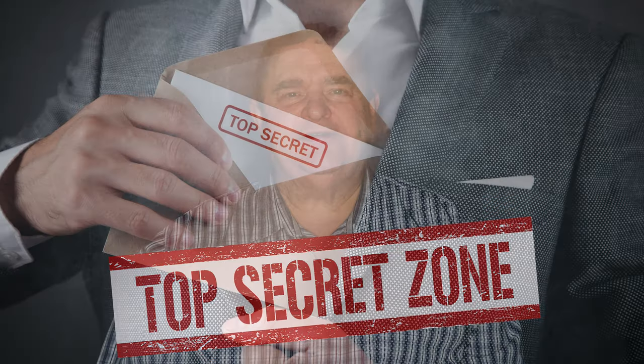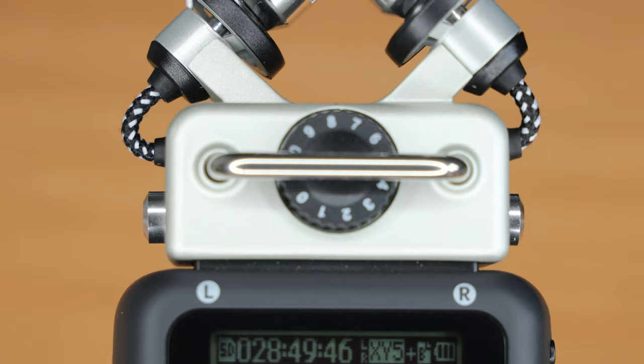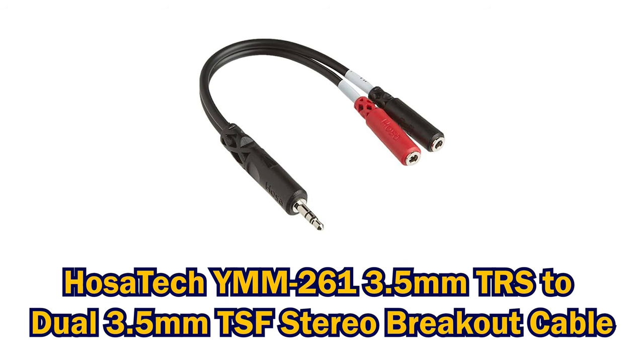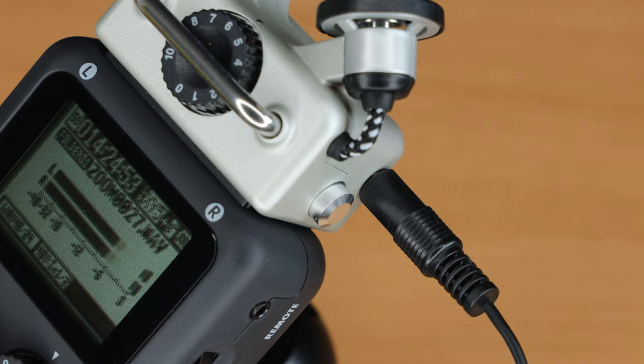Earlier I promised to let you into the secret of recording with up to four lav mics on your Zoom H5. To connect two lav mics to the 3.5mm socket on the side of the XY mic capsule, you'll need a Y-splitter cable — but it needs to be a special type to keep the audio from your two lav mics separate on the left and right channels, which makes editing much easier. I use a stereo breakout 3.5mm TRS to dual 3.5mm TS cable — link in the description. Plug your two lav mics into the red and black sockets, then plug the other end into your H5 recorder.